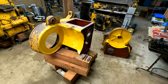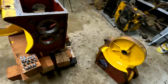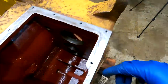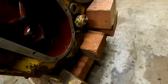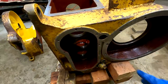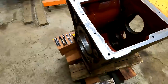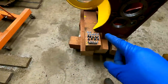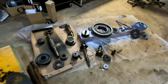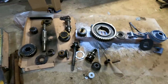As promised, this took about two or three weeks to get cleaned up and painted and prepped for everything. But you can see we're ready to install it. The only things I did off camera — I filled in some pitting here and down here with some steel stick, just because there were a couple of concerning areas. I sanded this whole flange. I also chased all the threads throughout this whole thing. I'm going to Loctite them and I'm still going to safety wire them just for looks.